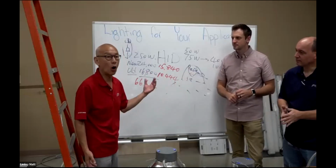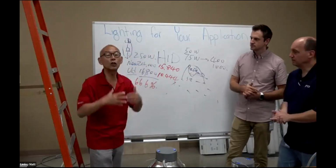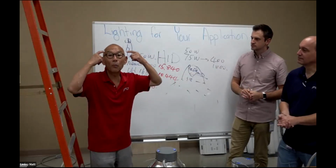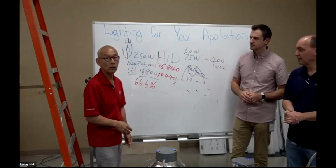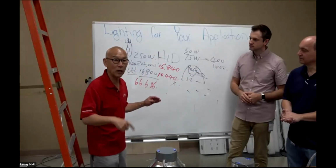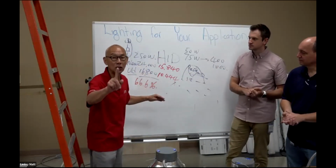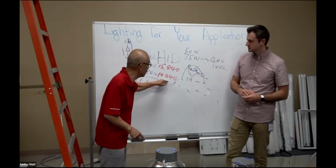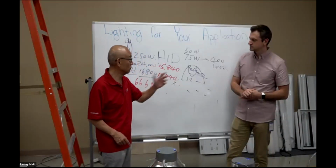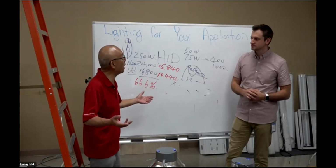A couple of years later, it actually depreciates like Paul said, 30%. So all of a sudden, the original 24,000 light source ends up at 16,800 at that point. That's what your eyes get used to. And if you put back a 24,000 level, your brain tells you, oh, it's too much light. So that's why sometimes we have to be careful about that. We always suggest to people that your measurement is not at 24,000; you'll have to match up to 16,800. And at 16,800, with 66% usable, you end up with 10,444. That 10,444 is more useful than the 15,840, by practical purpose, otherwise people say it's too much light.